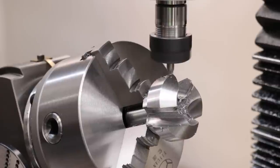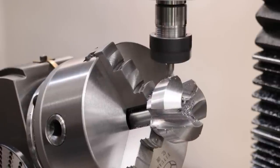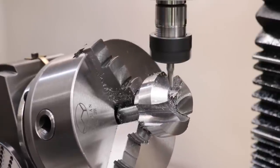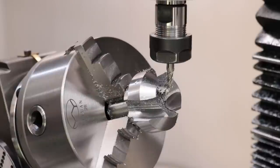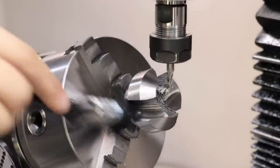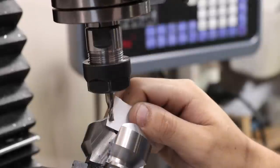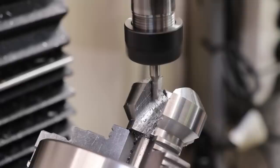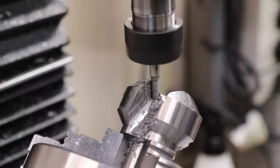The next few cuts were an attempt to remove material to help expose the area above where the insert would go — to hopefully make it easier to look down and machine it — but it didn't seem to do all that much, and to be honest I was kind of eyeballing it. To be completely fair, there really isn't all that much info on actually designing face mills specifically, so I was learning as I was going along. Next I'll cut the seat for the insert, which was made a lot easier since the insert is a square. I just have to make sure each seat is the same size, which makes the DRO come in very handy for this feature.